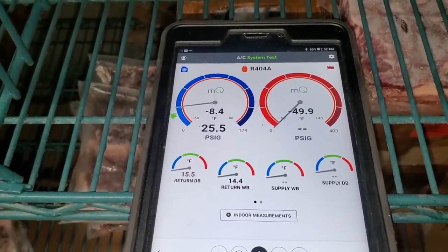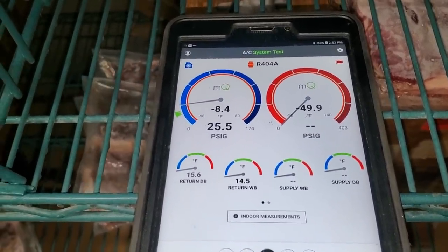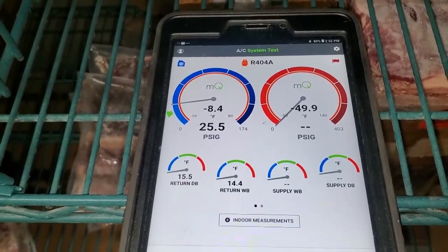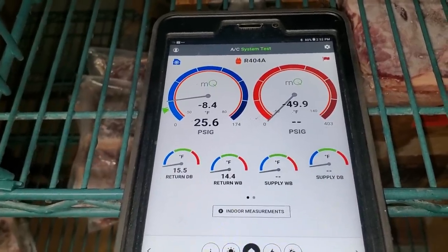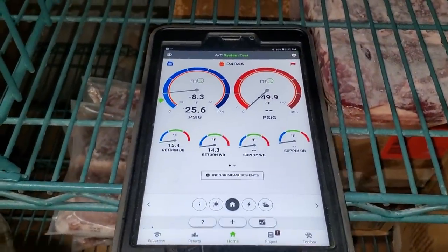If it was at negative 5 and I had 15 degrees superheat, I'd start adjusting on it, but these valves, to be honest with you, they're pretty much factory set on the Sporlan ones. You can usually get about 8 to 10 degrees superheat on the Sporlan valves without having to do much at all. So we'll do a follow-up on another day, but I'm super stoked with the way that this thing's working. Everything's looking good. We got, again, an even frost pattern on the coil. I'm a happy camper. So we're going to wrap it up and tell them to keep an eye on it.